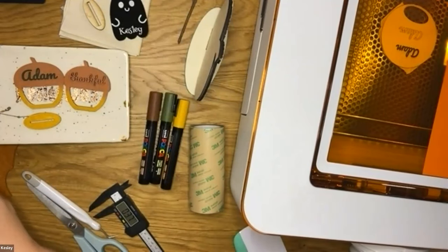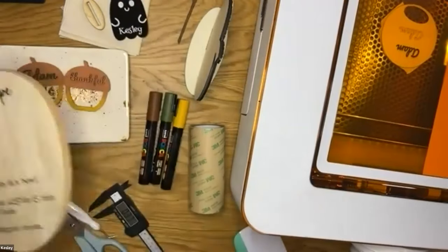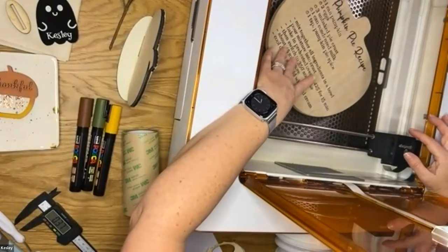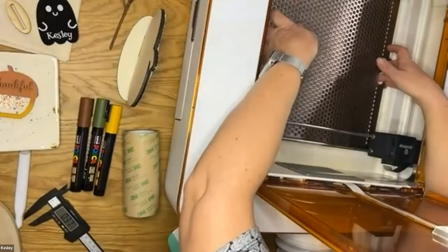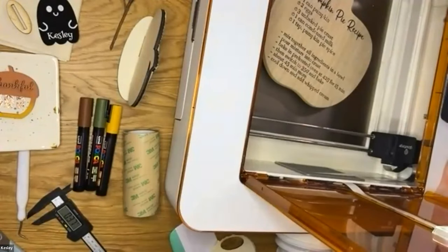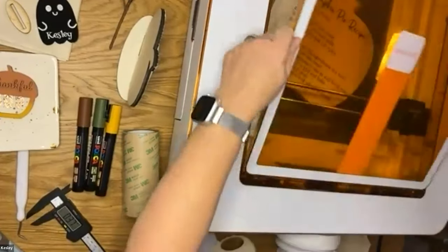You are also limited by thickness. I was nervous about engraving on this tray because it was about an inch thick. If you put something thick in the Glowforge, the laser head needs to be able to clear on top of it. What you can do is remove the crumb tray entirely — that gives you about another half inch of clearance — and place your item directly in the bottom. Then the head can slide right over it without interfering with the design.